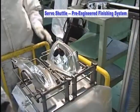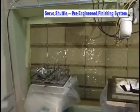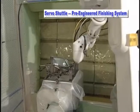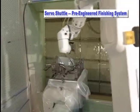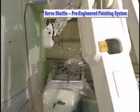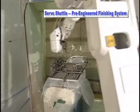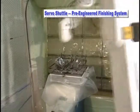When the painting program is completed, the next work piece automatically moves into the processing area with no time delay. The paint robot controller not only operates the six-axis robot arm, but also controls the additional two servo motors in the servo shuttle system. The easy-to-use Kawasaki C controller allows for easy setup and programming of all eight axes.